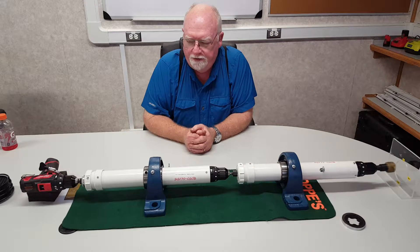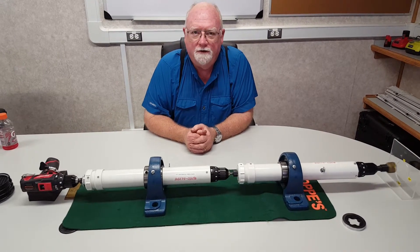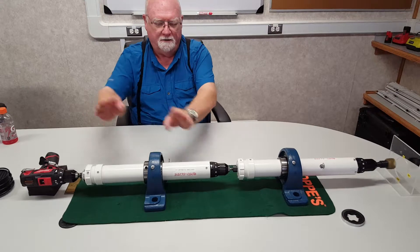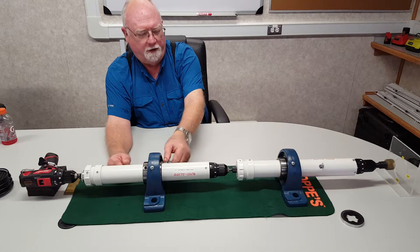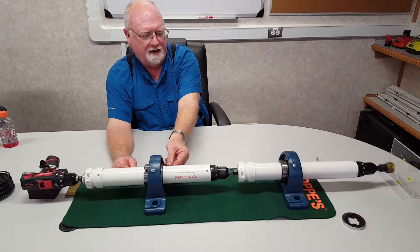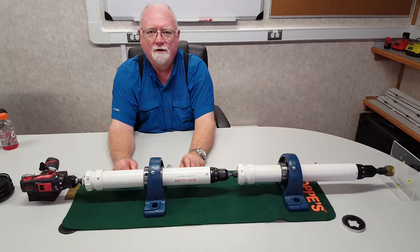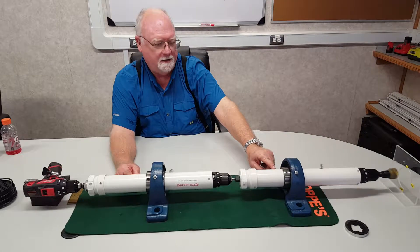What I've done is put in an upper motor to allow for continuous rotation of our drill pipe while holding the lower motor static. A top motor has been put in, connected to the bottom motor, and with flow going through this motor, it now turns the lower motor in a counter-clockwise rotation. The rotor inside this upper motor is turning counter-clockwise, hence the lower motor turns counter-clockwise.